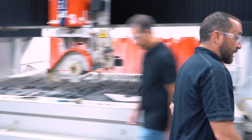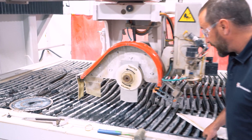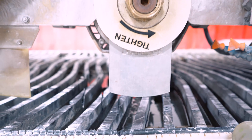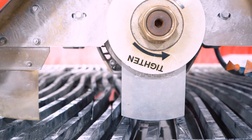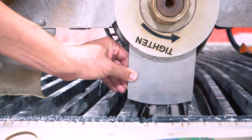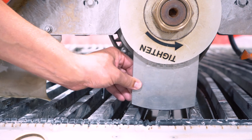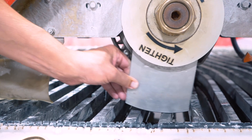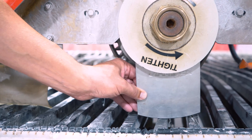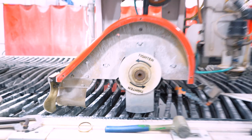Once we have that done, we're going to grab our pendant, find a nice spot on our table, and come down on that. You don't want anything that's too cut up or a bad backer board. Nate, swing this and just touch it off onto the table top here. I'm utilizing the slow button. Right there I felt a little bit of friction. Just scraping is what you want — right there I can feel just a slight bit of friction between the jig and the table. Make sure you utilize your slow button on your pendant when doing that.